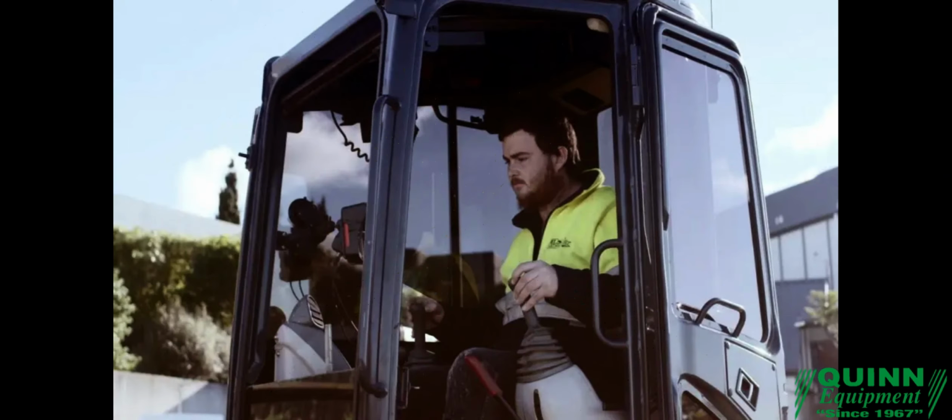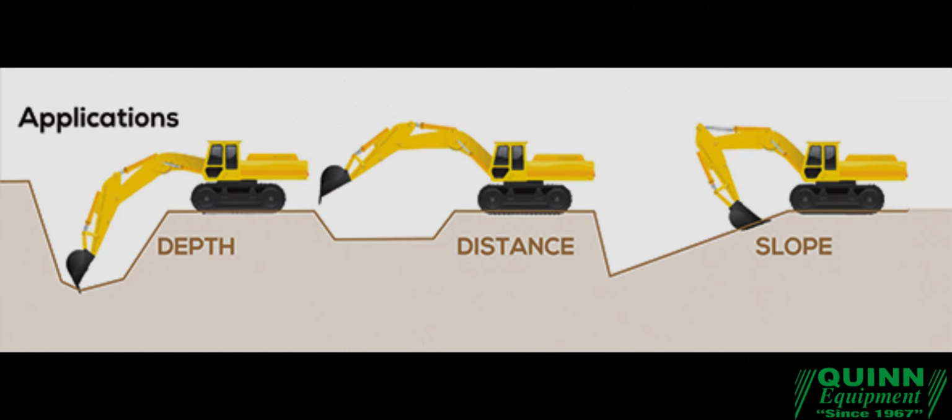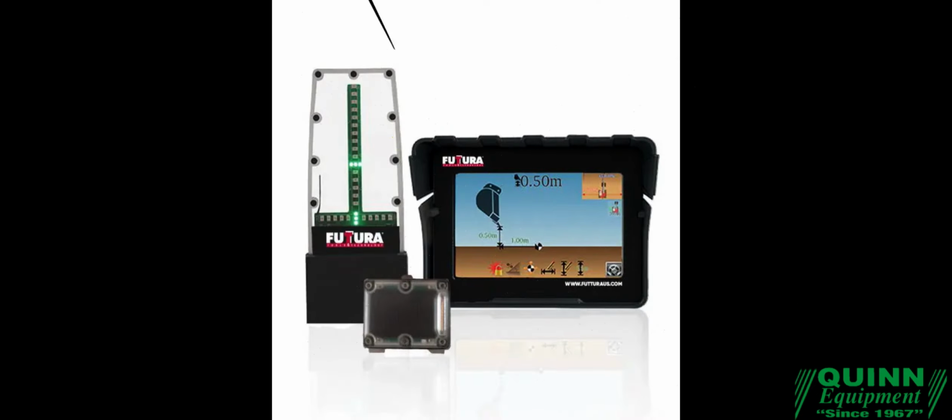The communication cable is not under tension. Use an extra XD418 cable if more length is required. The cable and plug into the sensor sticks out approximately 1 inch from the edge of the sensor. 2-3 inch clearance is desirable to avoid complications with the cable bending too sharply.